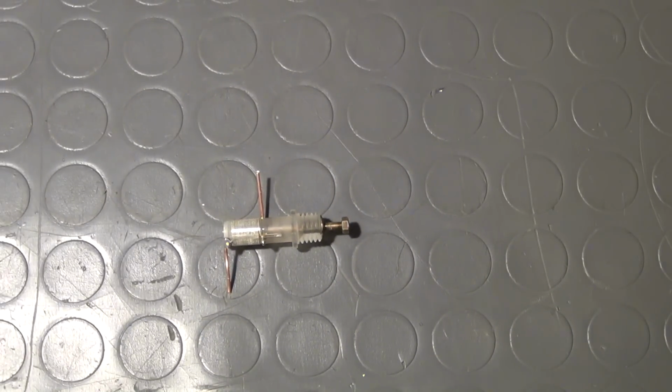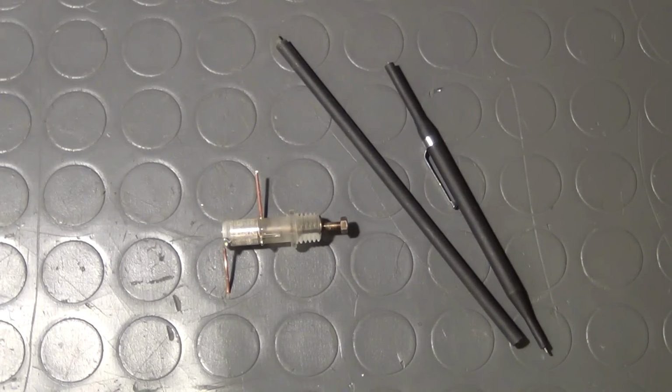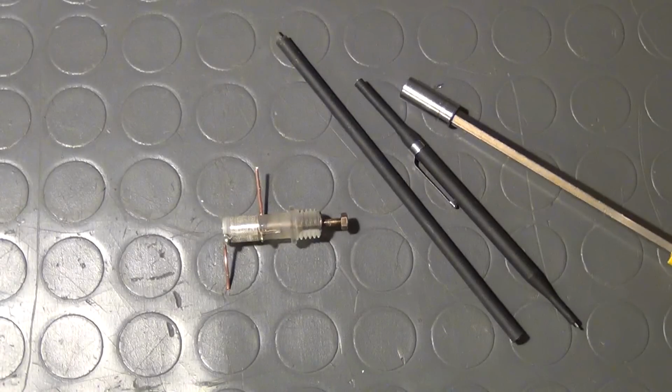Normally, adjustable inductors for RF applications are trimmed by a plastic rod rather than with a screwdriver for that exact reason. In this case, using a steel screwdriver would however be less of a problem because of the brass between its tip and the ferrite.